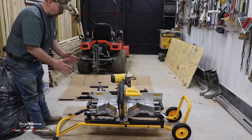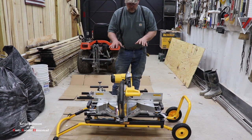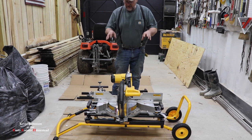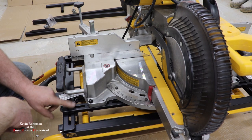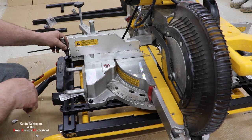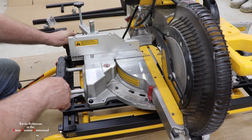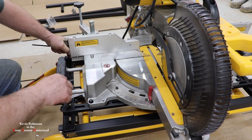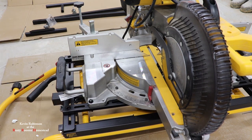What I'm doing is looking to make sure my saw is setting in the center that way and setting in the center this way. Now I think I have it all centered up where I want it. We're going to go ahead and start tightening all them bolts down. There's going to be six rail bolts and four tool bolts. We're going to tighten up the four corners on the rail bolts — the reason why is because the saw covers the center one. I won't be able to tighten it because the saw is sitting on there, so we'll have to move the saw and tighten the bolts underneath of it. If we tighten these four here on the corners, then the track should stay where it's at.